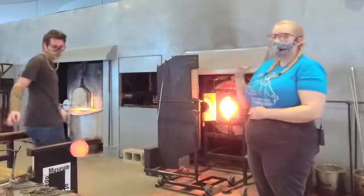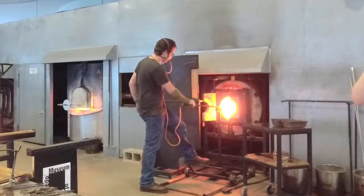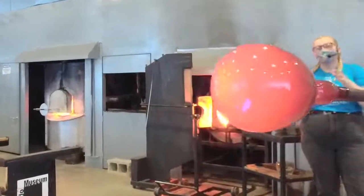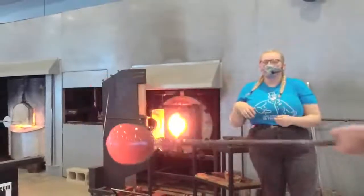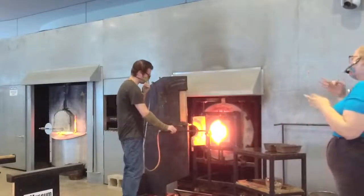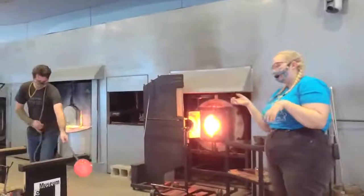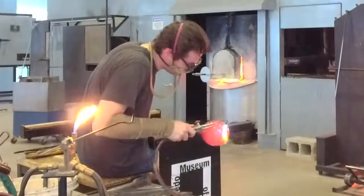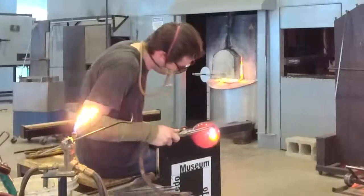He's just going back in, and now you can see our bubble is nice and sealed. This will end up being the top of our apple — it's a little bit backwards from what you normally see, but it allows us to really get a sculptural quality into our objects. You can see that nice line up there. When you work with clear glass, you can see your bubble on the inside, but color can really tell you how much heat you have. Working with something like white is tricky because it looks white the entire time. Another reason we really don't wear gloves is that you can only feel how the material is behaving through the pipe.